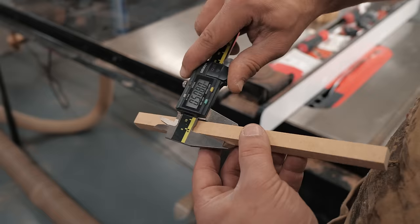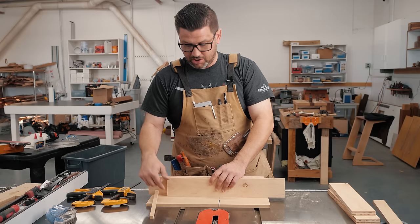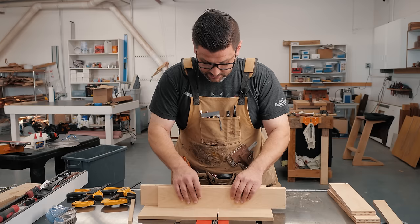I've put a half-inch dado stack in my table saw and I've cut a half-inch key. This is really long because I'm going to chop it up into a couple of pieces, since this is going to be our spacer. You saw in the intro where I had the adjustment block — so we need to make sure this is our sacrificial fence. It's not going to get glued down, it's only going to get screwed to this. We need to leave enough room to have a stop here and we're going to have those pieces of paper in between to be able to adjust it. This is our half-inch key.